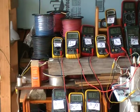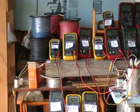We have 0.3 volts enabling 3.9 volts on the first resonant rise. Phase 1. Phase 2, we have a full volt enabling 4 and enabling 7.7 volts, Q 7.7. And on the third phase we have 0.4 volts enabling 4.26 volts, Q of 10. That describes the voltage side of the system.